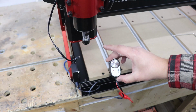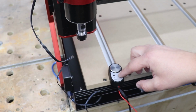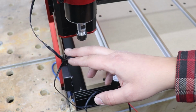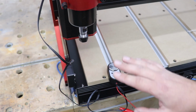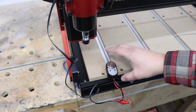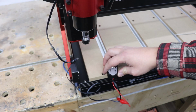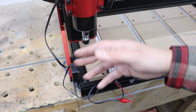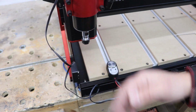You only need this for the setup, okay? So you can disconnect it. However, the more times you disconnect that from that port, the more likely you're going to pull the wires and damage the port itself. So preferably plug this in at the top in that port and leave it be, okay? Put it somewhere so it's not in the way as your machine is operating. This place, sure, could be all right. I don't know. We need to try it out and see if that will get in the way or the cables will cause any issues.